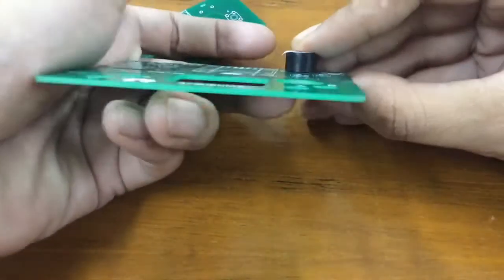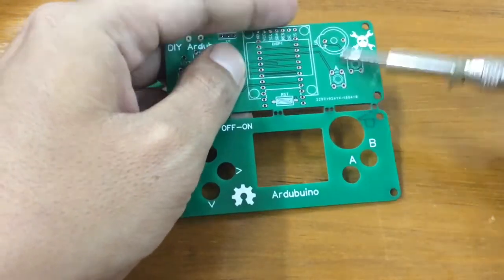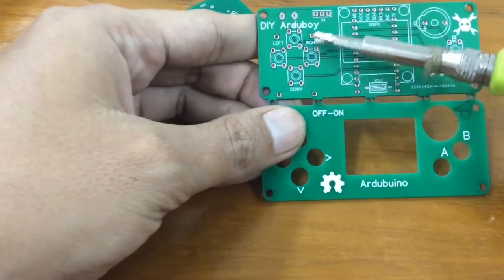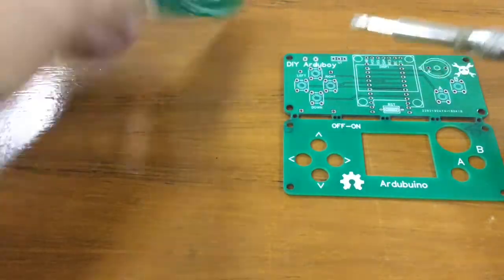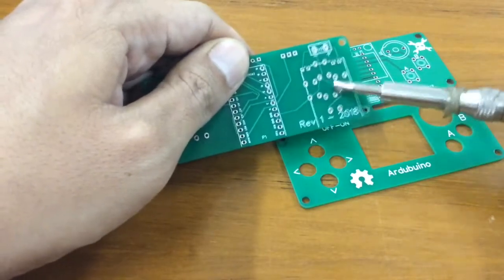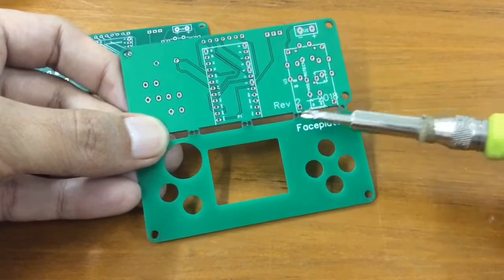Now it's flush and neat. The second change I made is I put a reset button here so you can reset your Arduino Pro Micro directly on the board. I also made a few footprints for the TP4056 so you can solder it properly — the previous version only had two pads and the wrong size. I made changes to make it fit correctly, and this is now the correct size on revision 2.